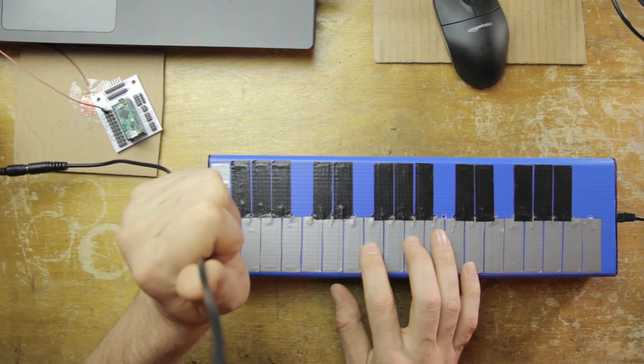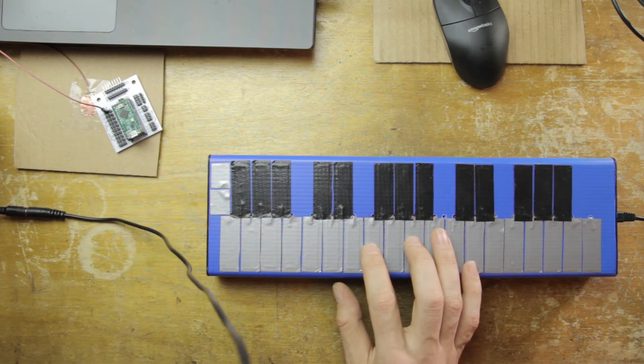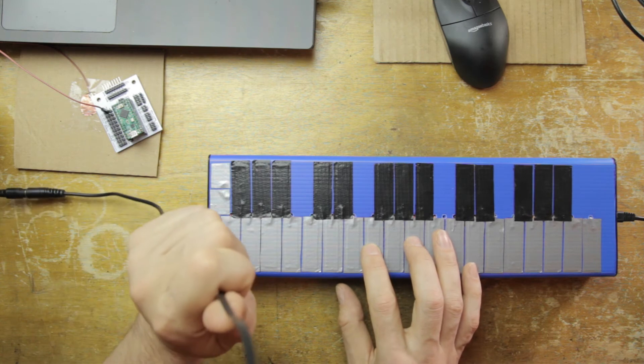Even just handling this cable here — the power supply is obviously not conducting electricity directly into my system, but it is interfering with the electrical field enough to mess with my sensors quite badly. I don't know exactly where that specific signal noise is coming from, but I did spend a lot of time troubleshooting this issue so that you don't have to. If you are suddenly getting a lot of noise on otherwise perfectly good capacitive sensors, have a look around your setup for dodgy power supplies and ungrounded electronic devices — and definitely do not put them in your pocket like I did.